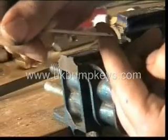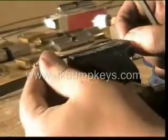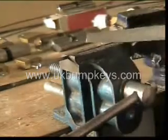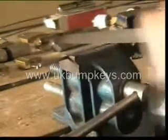That's done. Now I'll take it out and show you briefly. Can you see that there now? We've got a triangular point, which is like a pick. Normally I wouldn't have taken that out of the vice, but just to show you what's what. I'm going to put it back in roughly halfway again. Now using the big file this time, all I'm doing is filing some of that excess away. You don't have to do the whole thing, just the end bit where you pick — just move that up a bit so I can get a little bit lower down with that.